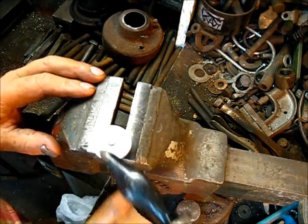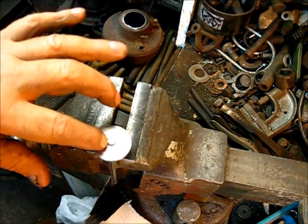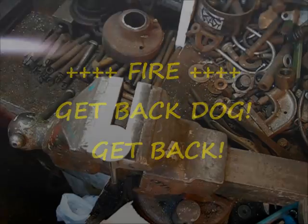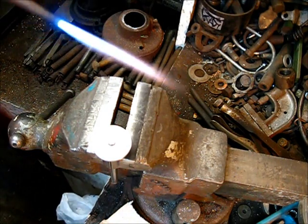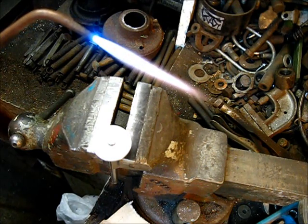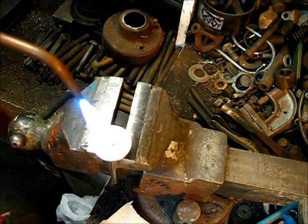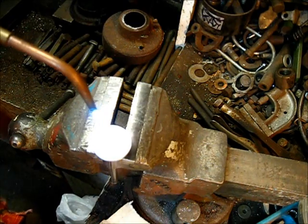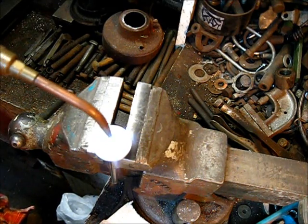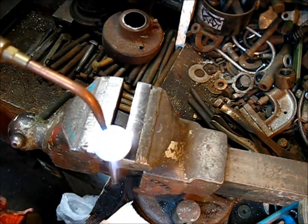You want that to be really tight so that stem does not move downward, because what we're going to do is pin the head of this valve over and fill up that bevel in there. We're going to have a nice decent flame right there, heat the end of that valve to cherry red, and then mushroom that over. This was a pretty decent press fit.